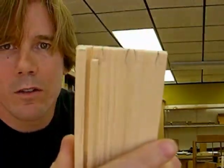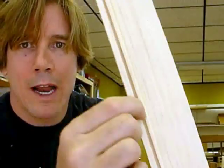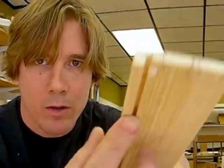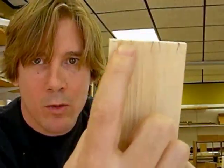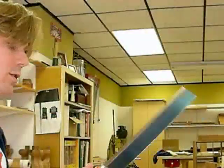These are the marks from the back piece. And I had to cut this little piece off. This is where the rabbet goes. This is where the bottom goes into this little tiny dado. So I cut it with the marking gauge, and I cut this part off, I marked it. And now all I have to do is cut them out with the saw.